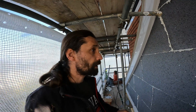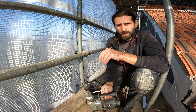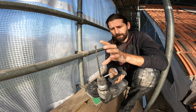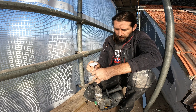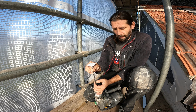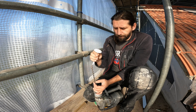When I'm going to install this type of fixing, I'm just going to go onto the corner of the boards and into the middle, so more or less the boards are going to have around five or sometimes six fixings on them. I'm going to use my hammer drill with a 10mm drill bit by 250. Before starting, I'm just going to measure my drill bit and put a little bit of ducting tape on because I don't want to go too deep with my hole.